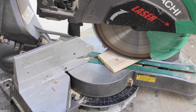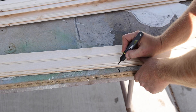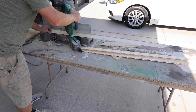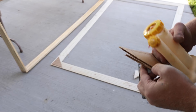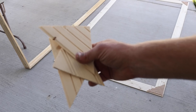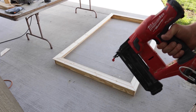It's hard to measure the end of a miter by yourself, so I'm just measuring the edge of the table and lining it up. I marked where I needed my cut to be — this is going to be my 45-degree going up out of there. When I'm marking miters, I always do a little dog-leg mark so I know which direction the cut is going. For this part of the frame, I'm using some pretty heavy cardboard in the corner with glue and a half-inch handheld stapler. I was going to use triangles, but they were way too thick and the staples weren't going through them.